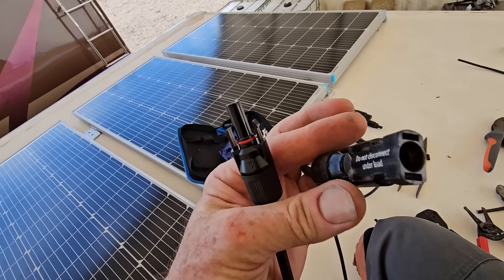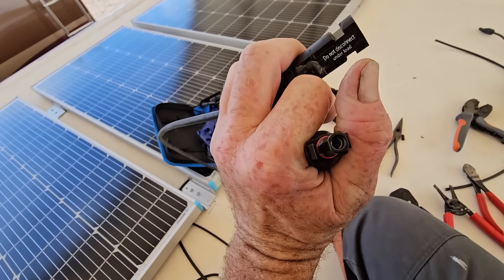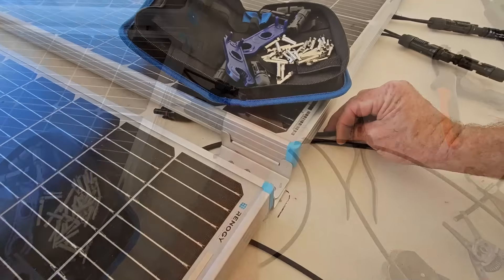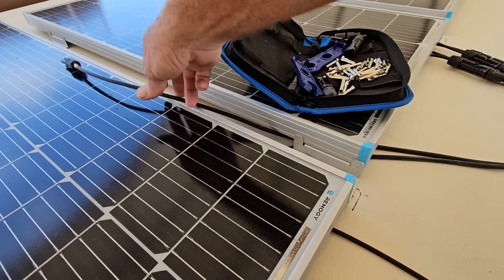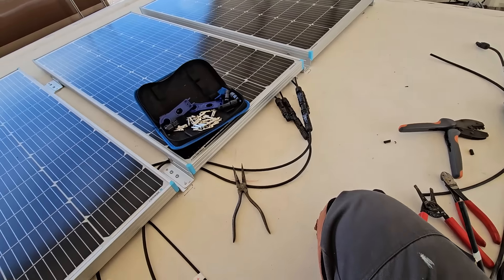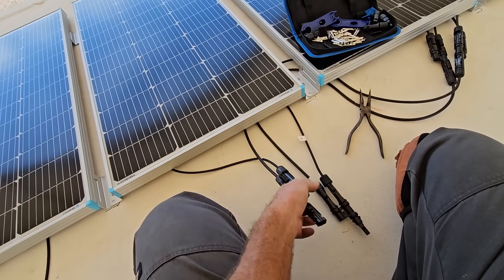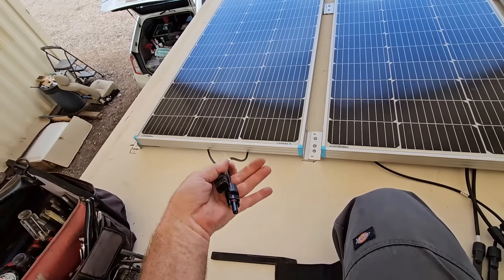It's a little more complicated than I want because the kit only came with two-to-one Y-connectors instead of a three-to-one. So I have that panel and that panel in parallel — these are the positive leads, these are the negative leads for those two panels. I made up a cable to link them up with the negative on the third panel — all in parallel, negative, negative, negative. Then I made another cable for the positive side. It's MC4 connections — the plastic might be female but the metal pin is male, and vice versa. Make sure you're not reversing polarity and damaging the panels.